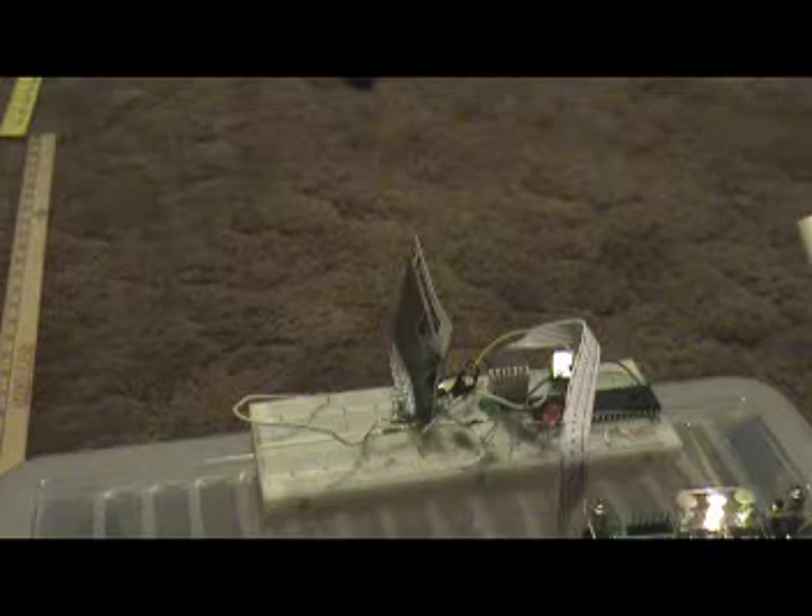The goal is that the robot will receive the signal it sends out from the infrared emitter and not a signal from this remote. So if we press a button here, you can see that the green light is receiving a 38 kHz signal, but the red light is not on, which indicates that it is not receiving the same code as what I am sending out.